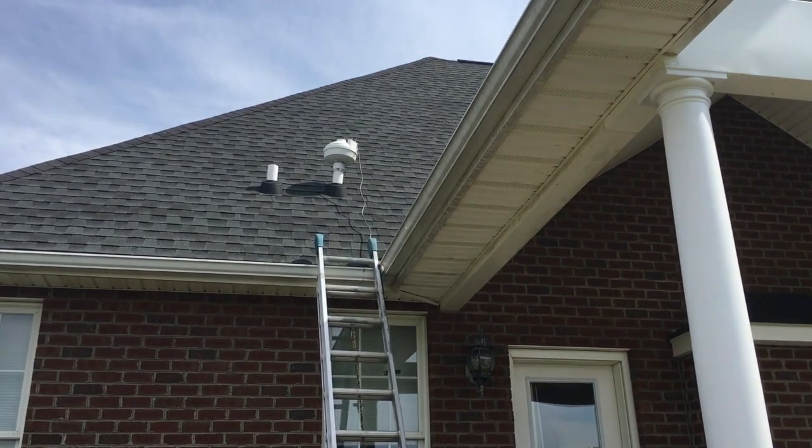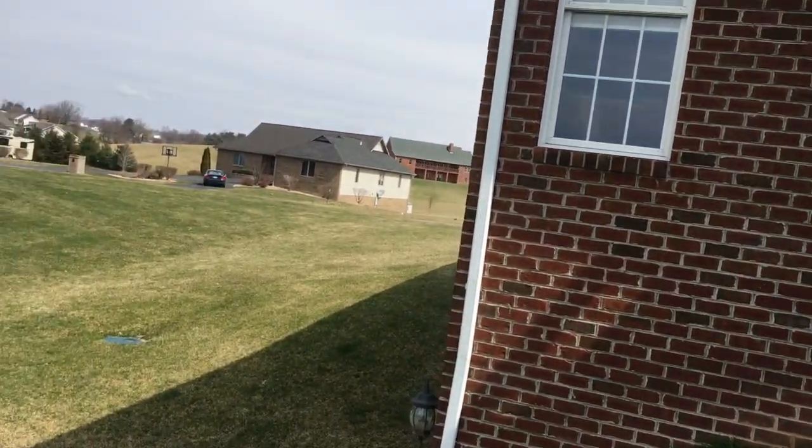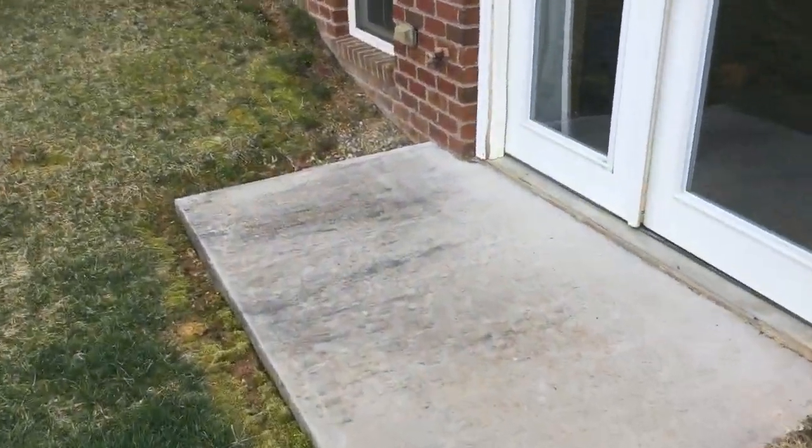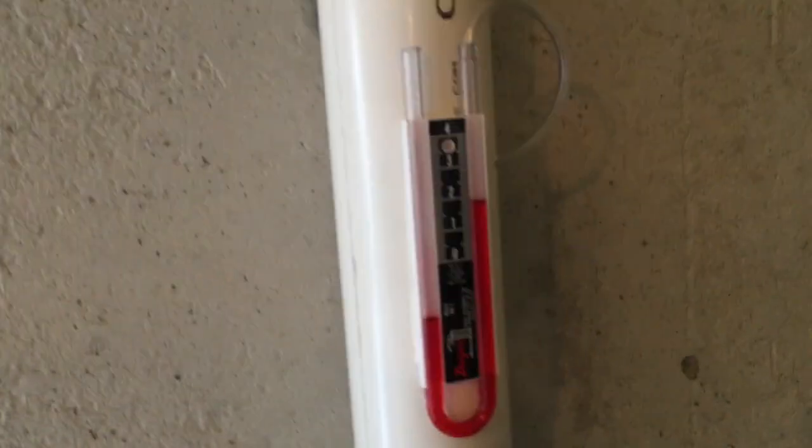I've got that fan attached to the very top of the radon stack. We identified the pipe down here in the basement and we are moving a good bit of air. I was concerned because it sits so close to the wall — I've had situations before where the footer was interfering with airflow, and that's why I wanted to test this system. I attached an extension cord to the fan and fired it up, put a manometer to it, and also felt on top of the fan to see what the airflow is like.